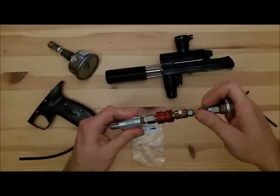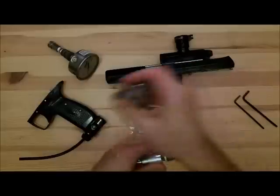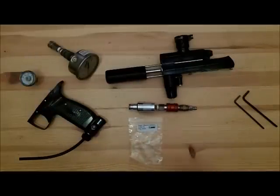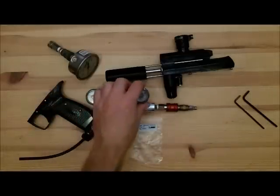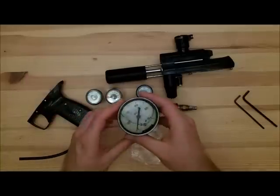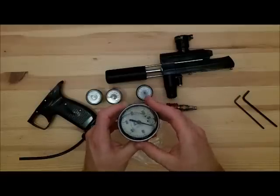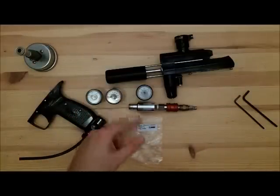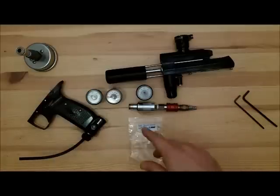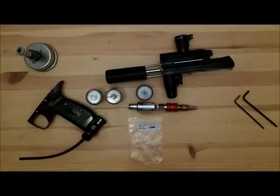This is going to sit like this. I'm going to test this thing once a month — it was very well done. He sells them with gauges and without. I like to have multiple gauges for different applications. I do have one sort of expensive do-all gauge, which is this liquid-filled gauge. It's seen better times, but it's not the fastest recharging, so it's not the best to test recharge with necessarily, but it is the most accurate that I have. These button gauges can be inaccurate — plus or minus 10%. So what I tend to do is just know where the needle is when I set it correctly, and then it just needs to be a consistent number.